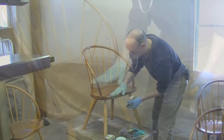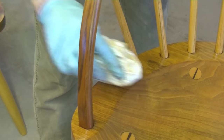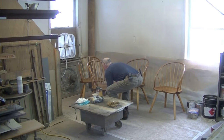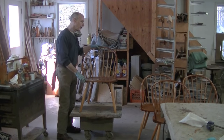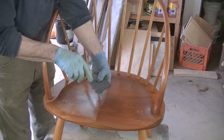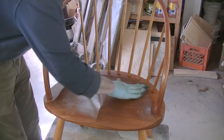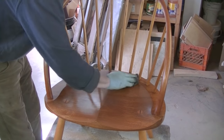Now the seat. I'll let that dry overnight. This third coat has dried overnight — they look really good. They could almost go the way they are now, but just to make them super smooth and super nice, I'm going to go over them with some 4-0 steel wool and my beeswax and orange oil polish — just very, very gently, not applying a lot of pressure. And I'll ask the owners of these chairs to continue using this polish.